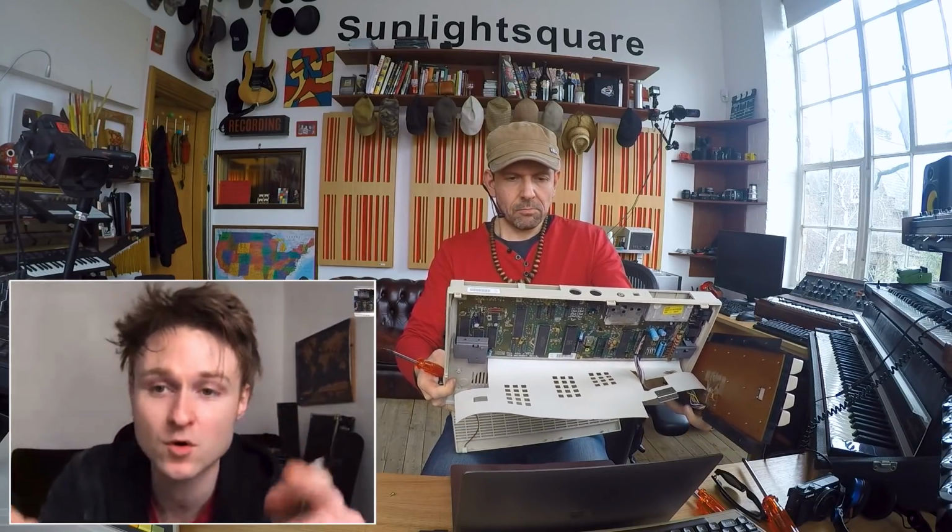Okay, so just bring it up closer. It has got the removable SID chip. The motherboard will look slightly different, but I don't think it will affect you. I think all the mods that you need to do is you can put that motherboard into the bread bin. I can't remember exactly the modifications that we did, but I don't think there was a large amount that will be quite confusing. It wasn't super massive. If you've got a problem, send me a picture of it. But first, definitely try the Luma fix, the trim pots.